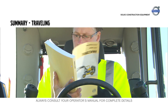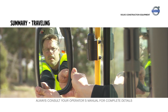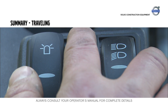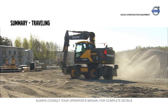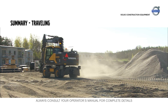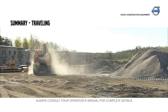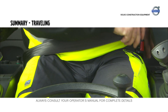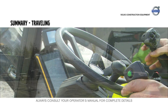It's important to know your machine dimensions and the local regulations. Make a proper mirror adjustment for the best possible view, and make sure the front oscillating axle is unlocked. The oscillating axle will absorb uneven ground and obstacles in every gear for higher operation comfort and safety. For the same reason, check the lights, buckle up, and adjust the steering column to provide a better view of your workspace.